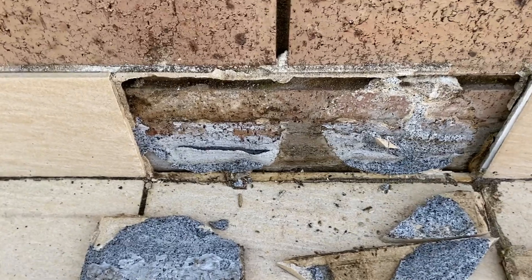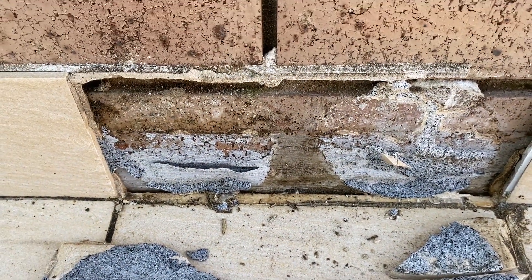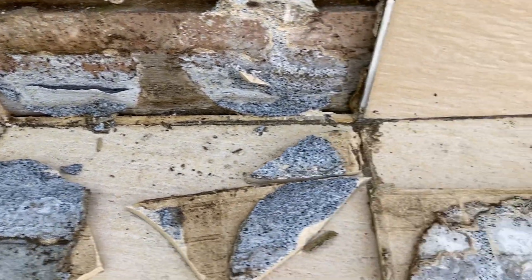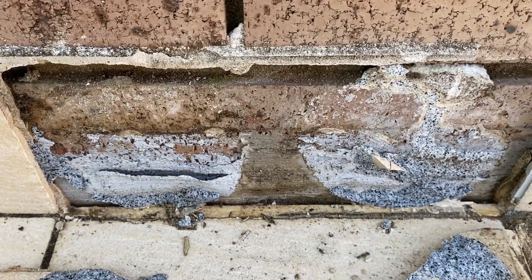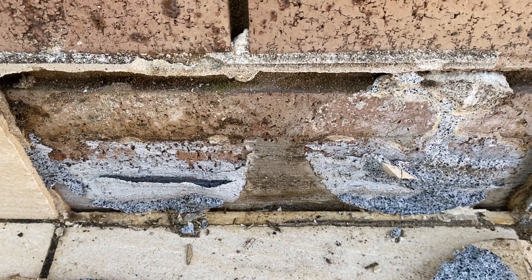The membrane is slightly torn where a previous contractor has pulled off the tiles — the membrane has been damaged. The skirting tiles are dab glue applied, which isn't perfect, but they're well fixed. It looks to be a compliant waterproofing membrane with a fabric reinforced bond breaker at the corners.